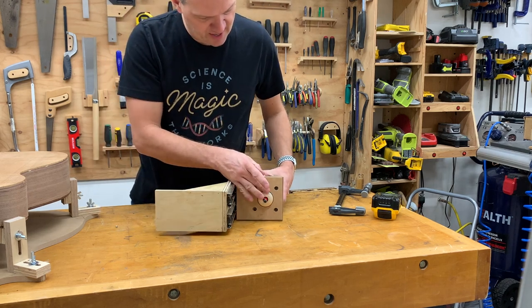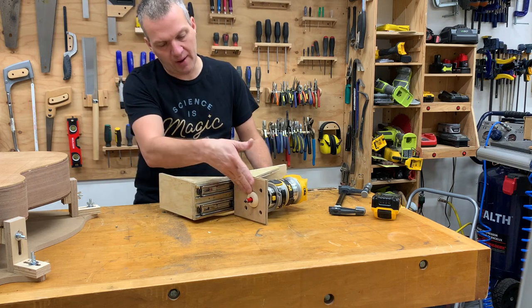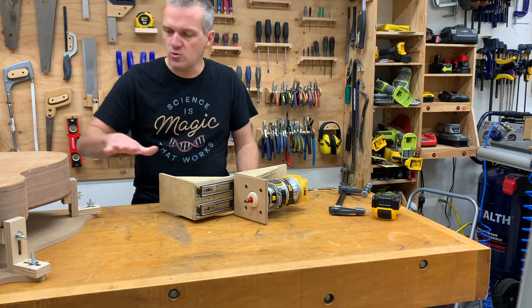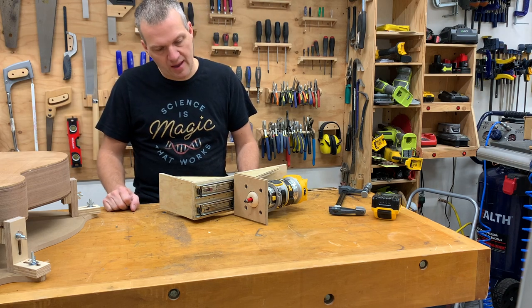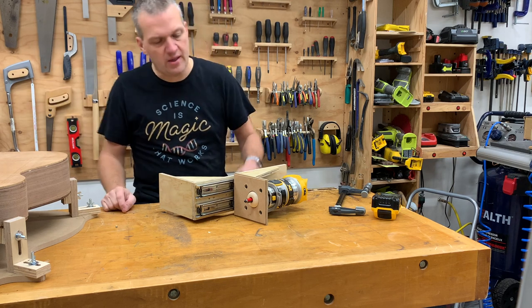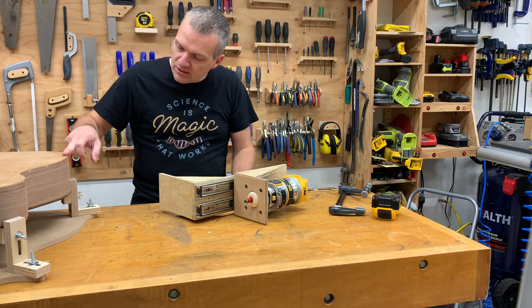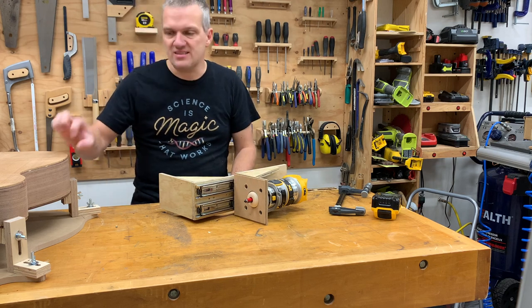The little donut here is actually used to be sure that if I had to have the whole plate lay on the bottom of the guitar, the flat side would be okay, but on the bottom side of the guitar, which is actually a little curved, it would ride along the body too far away where the arch begins to show, and it wouldn't allow me to have the correct height for the cut all around. So this allows the actual jig to lay on the very edge of the guitar, and the little edge here is not curved very much, so it allows a consistent height all around the place.